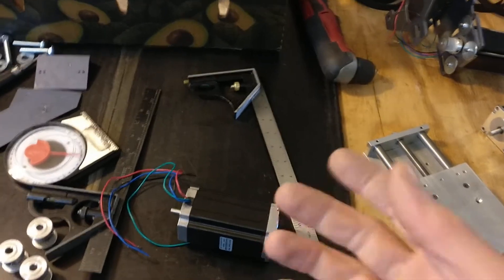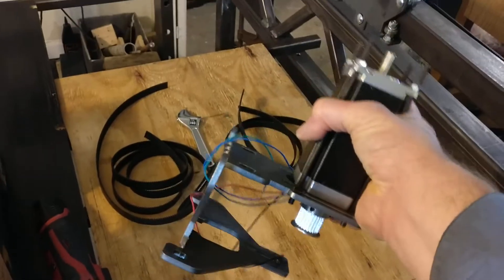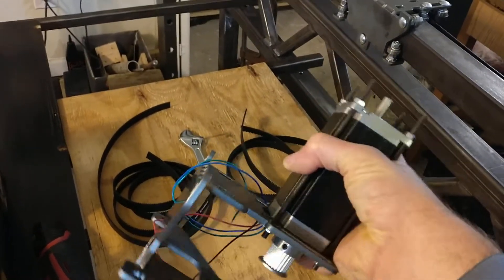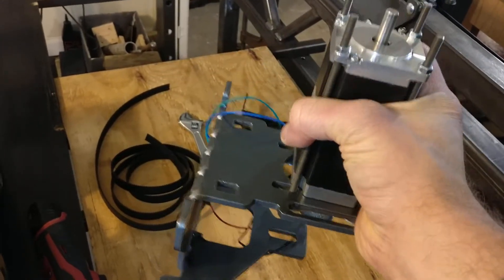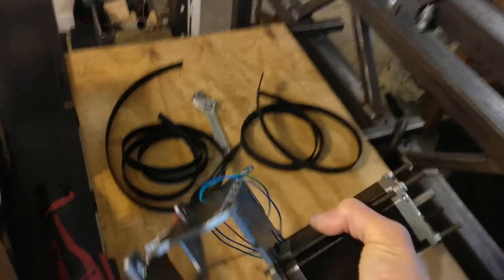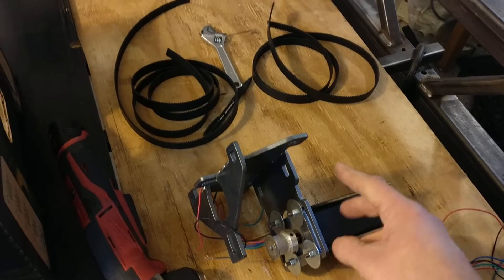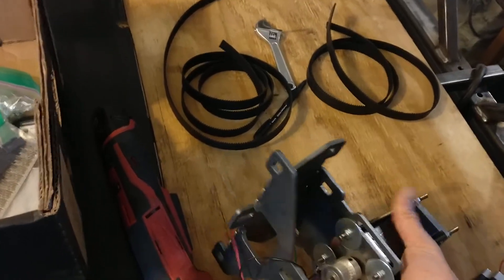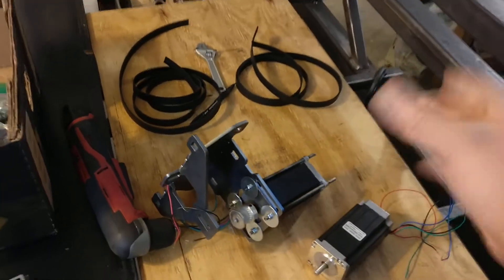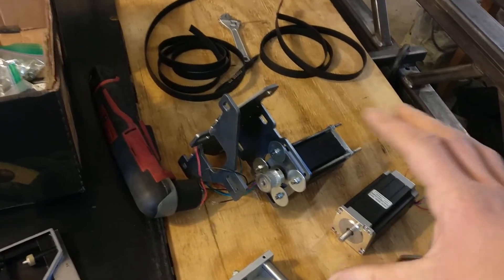An upside-down motor on this machine would be bolted on the carriage with a bunch of long five-millimeter ready rod. While this would probably work, it just doesn't sit right with me. Having that long length of rather thin ready rod while this carriage is zipping across an axis at 600–900 IPM on the rapids seems likely to torque a bit much with that much top heaviness, so I'm not really fond of that.